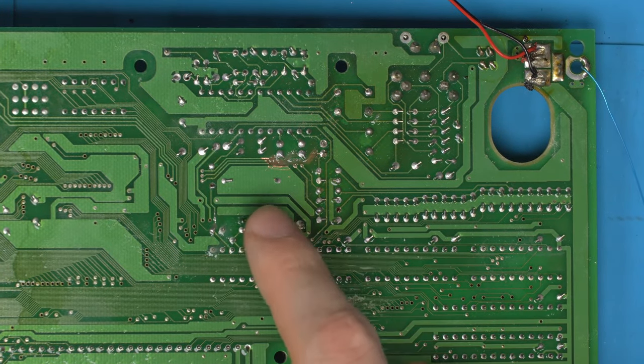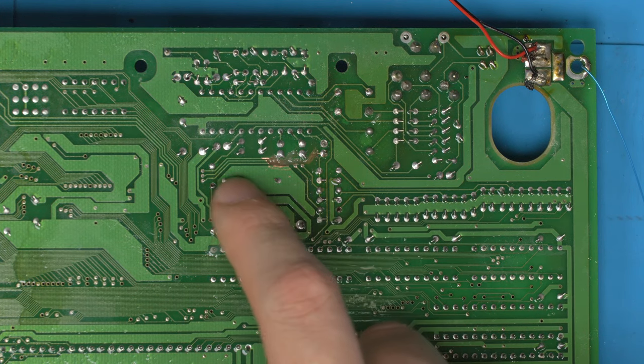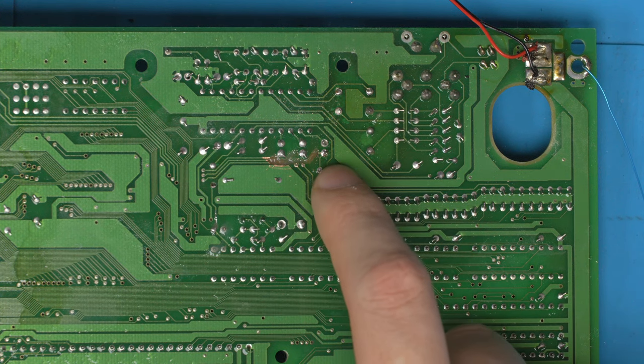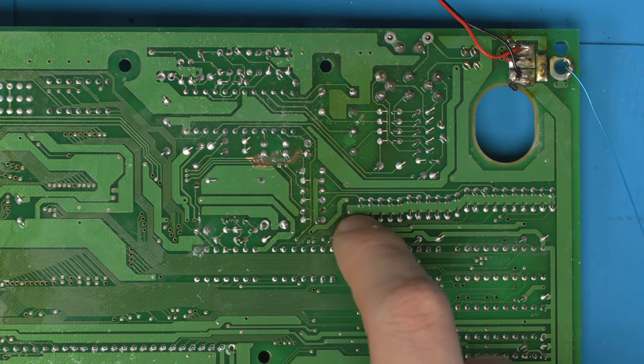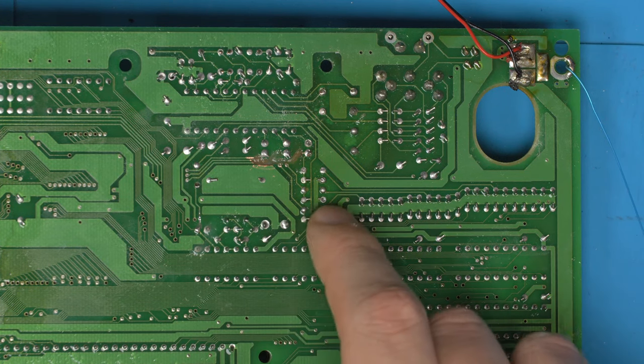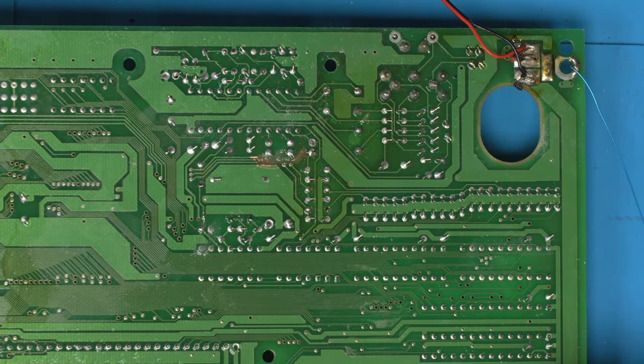We now have another issue where we have a slight bit of crystal noise, and you'll see here the crystals are here, the resistor network's here and passes over here. So we'll track back that further, and I'm guessing it's going to be something in this area that is also too close to the output, and we'll come up with a fix for that.